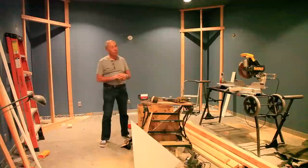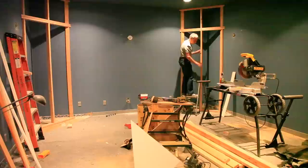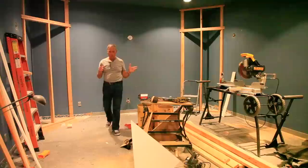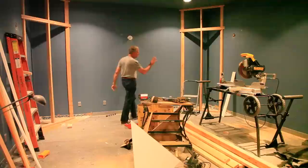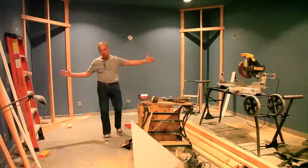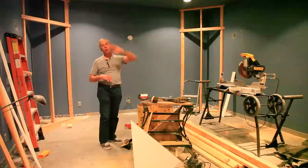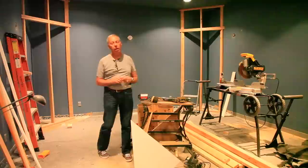One of the things that people could do is build what we call bass traps. We had talked about that at first — building these corner bass traps with a tube going up into the ceiling and venting out with a lot of absorptive material. That was a great idea, but when we started really examining what we were trying to accomplish, we realized that a corner trap like that is what I have to term broadband coverage. It's going to reduce the bass over a large range of frequencies in the corners, and we don't really want to do that. All we want to do is even out the responses — the boominess part of the room. To do that, we need a tuned filter.